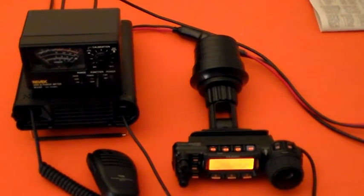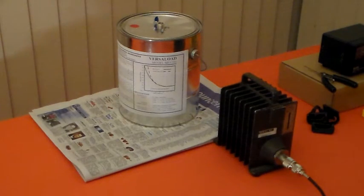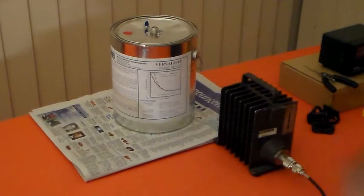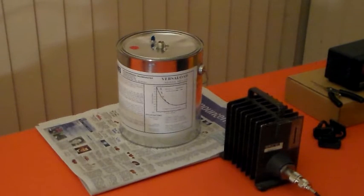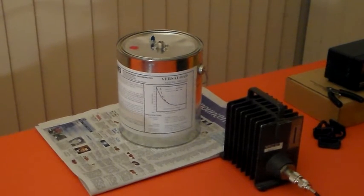Thanks for watching again, as always. Just to leave you with a final look at the two dummy loads - the MFJ250 by the way is not leaking oil, so that's a good thing. No oil on the paper. I think we'll give that a pass as a budget high-power load, because you can supposedly put one and a half kilowatts into it for 10 minutes. Depending on how much power I get out of my HF amplifier, I am mindful that if the oil does start to heat up and give off fumes, they are carcinogenic - you can't breathe the fumes.